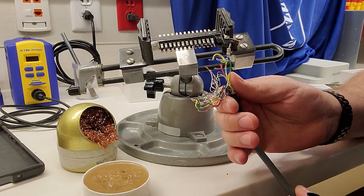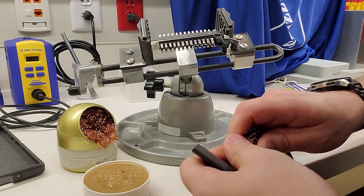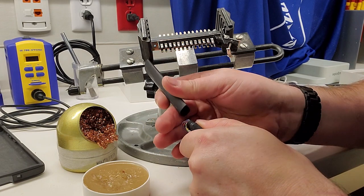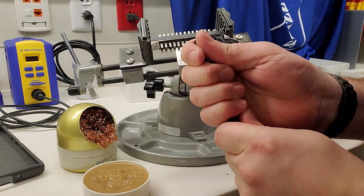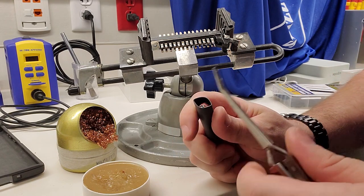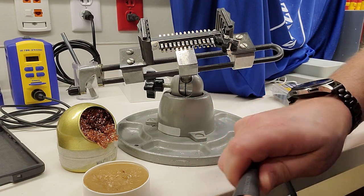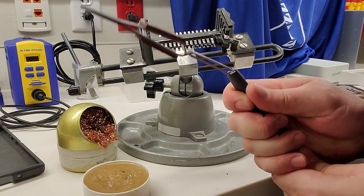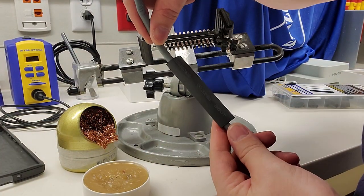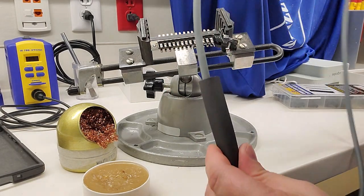Once all your wires are disconnected from the connector, straighten them out as much as possible — just give them a little twist. What we're going to do is fold the wires over so we can put the shrink tube on the cable and push them all the way through. Once the wires are almost all the way through it will be difficult to pull, so grab your pliers or tweezers and give them an assist — just a little bit from both sides and it will come right through. Now slide the shrink tube all the way down the cable to the site of the repair.